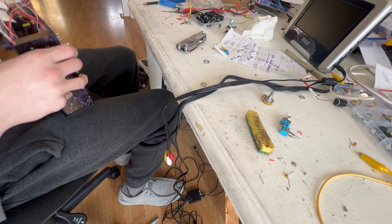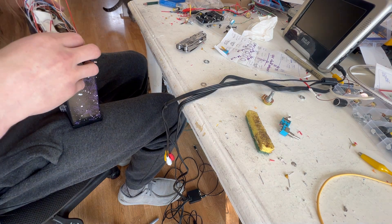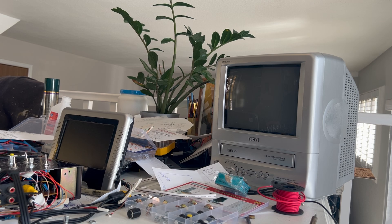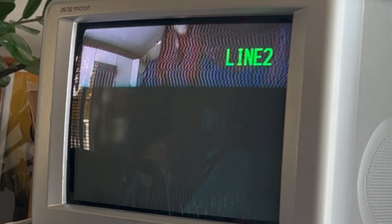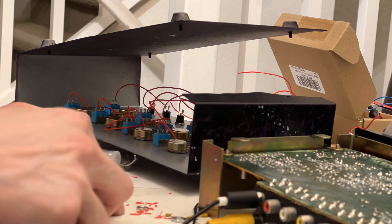Closing the whole case up — bad, bad, bad. Learned my lesson right here. Thankfully I didn't go ahead and close up the very back of the case, that would have made it leagues more annoying. Went to turn everything on and noticed that it was perma-bend — or rather, I thought it was for a second. Thankfully I recognized this bend, so I knew exactly where to find this bend point on my bay of switches and potentiometers. I was able to find out I had burnt one of my switches, replaced that, re-soldered everything, put it back together. Thankfully it all came together well this second time.